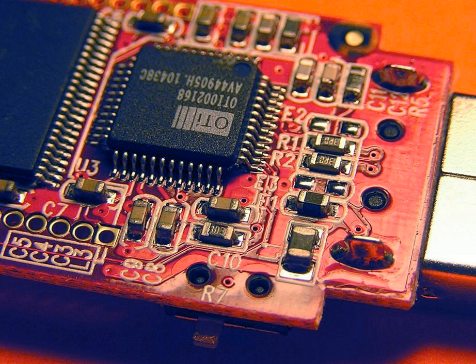Very small outline package VSOP, even smaller than QSOP, 0.4, 0.5 mm or 0.65 mm pin spacing. Dual flat no lead DFN, smaller footprint than leaded equivalent. Topic: Quad inline. Plastic leaded chip carrier PLCC, square, J-lead, pin spacing 1.27 mm.